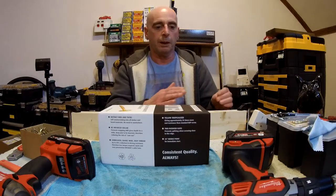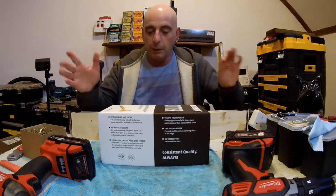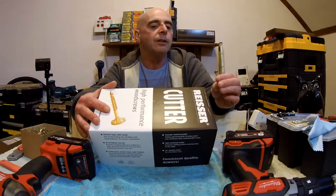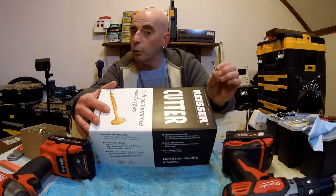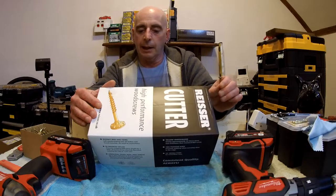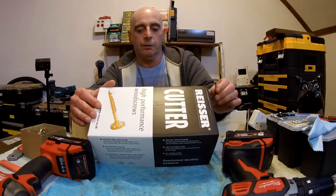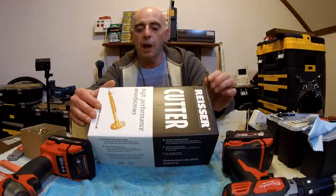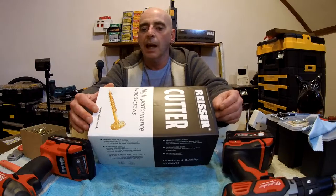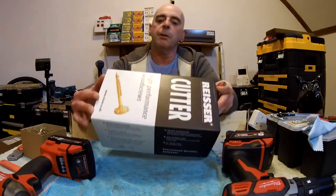It's the setting of these screws down to the wood. I had problems last time with splitting wood, and the Turbo Gold — Turbo 2 — was doing it as well. What we found is this screw doesn't actually like sitting completely level with some woods. We read the box and it says ribs and tucks enable the screw to set flush and tight without surface damage, but it doesn't actually really sit level. The more we tried pushing it level, we were actually damaging the wood.